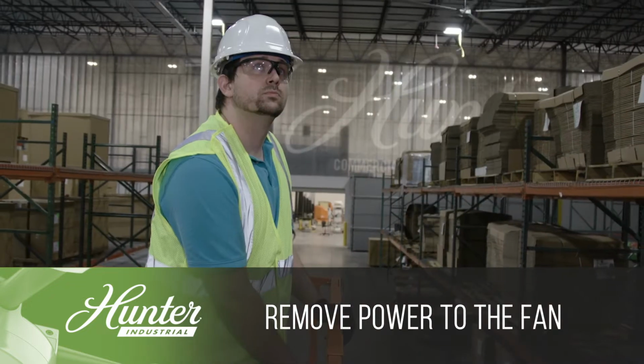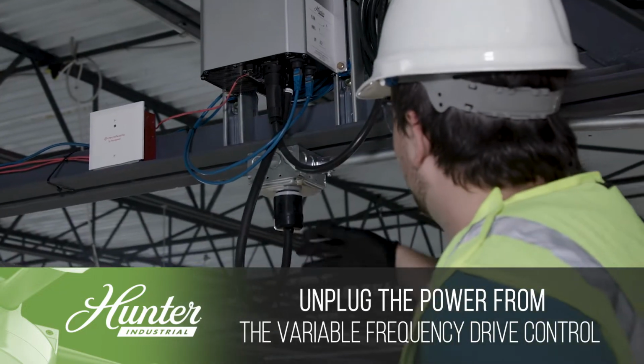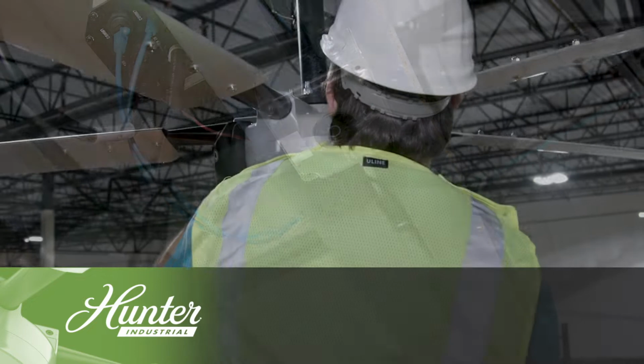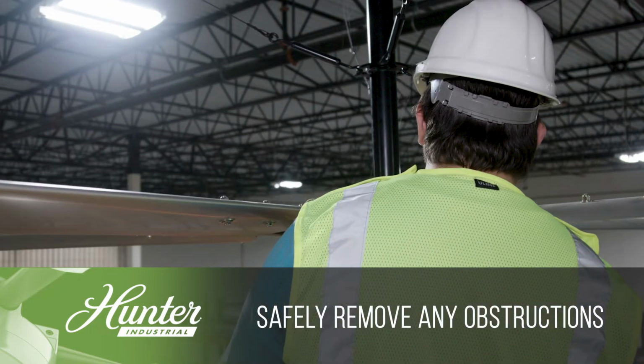Once power from the breaker is turned off, unplug the power from the variable frequency drive control as a secondary assurance it is safe to approach the fan. Next, safely remove any remaining obstruction from the blade sweep area.